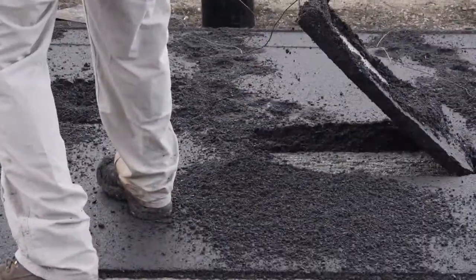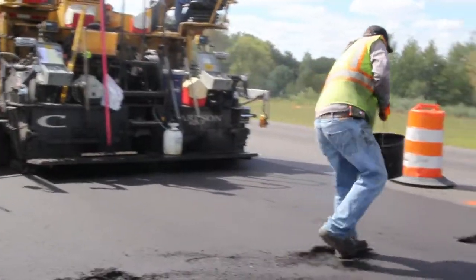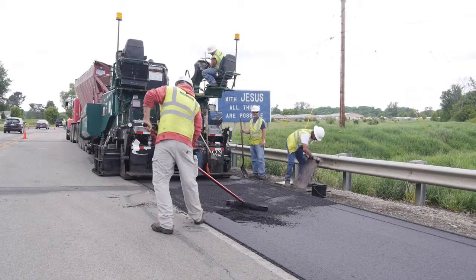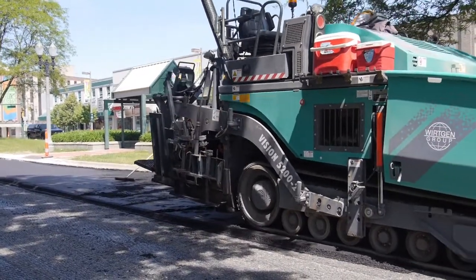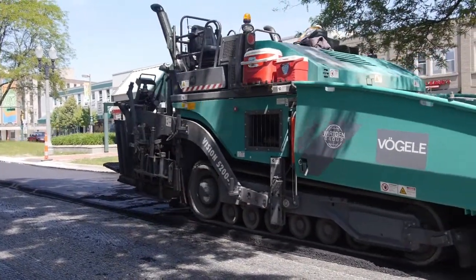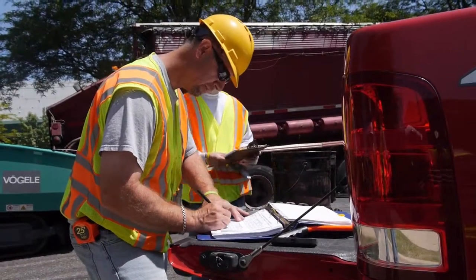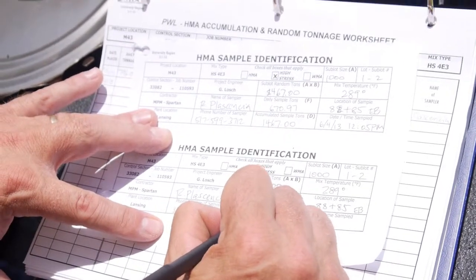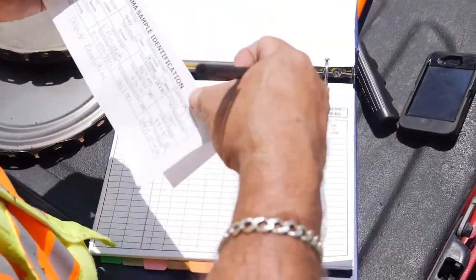Remove the sampling plates from the pavement. The contractor will fill and level the void left in the pavement with HMA already obtained from the paver's auger system. The contractor may back the paver up over sample areas and pave over disturbed sampling areas. Once the sample has been obtained, be sure to fill out the form titled Sample Identification for HMA Mixture Street Samples, and place the form with the appropriate sample.